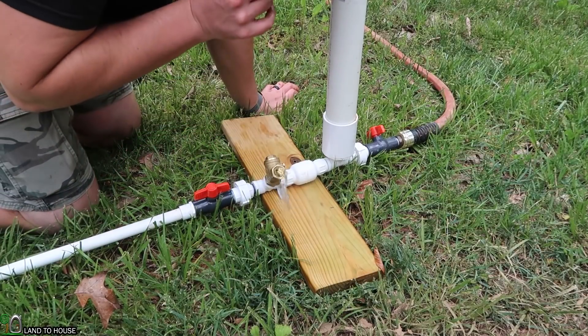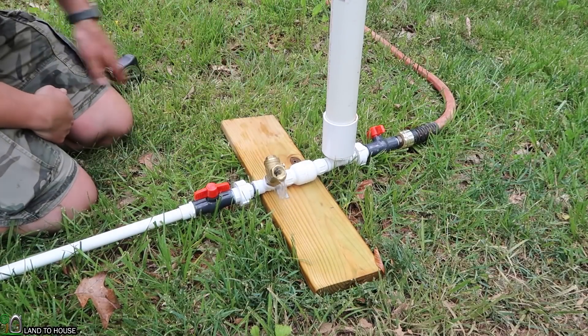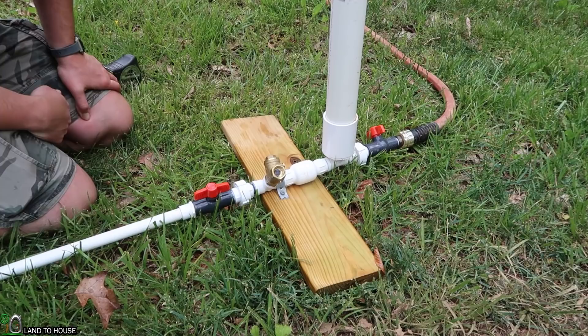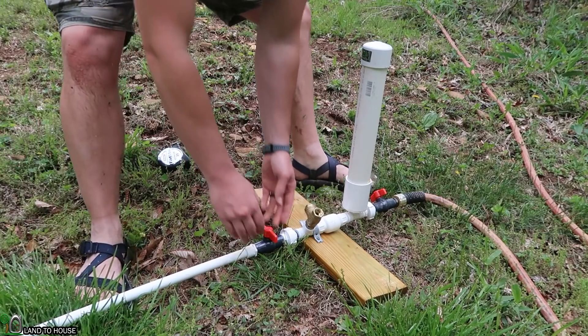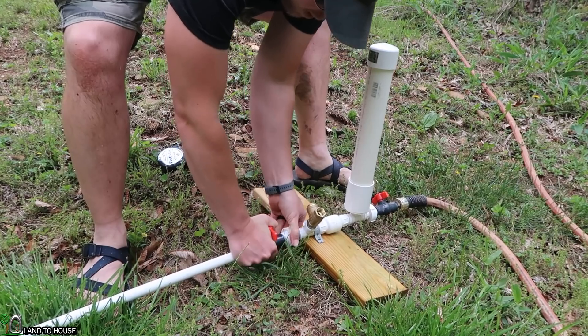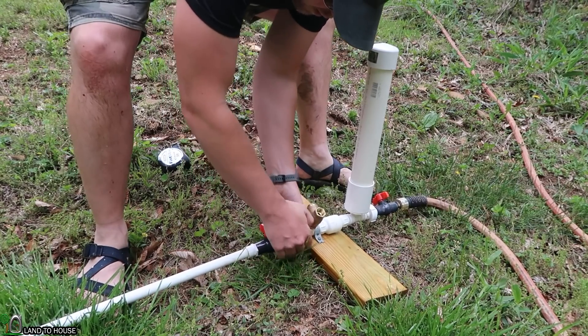So it should start on its own now, but that will greatly reduce the efficiency out. So we now know that we are working with 20 inches of head pressure. Let's see if we can go lower. I just scooted the pump further up the hill. Let's go ahead and remove this again and find out what our new head pressure value is.